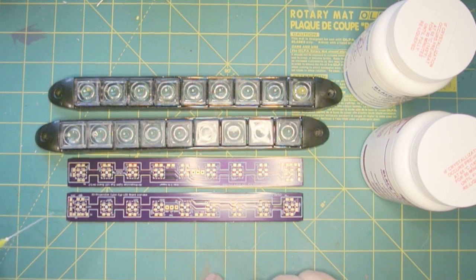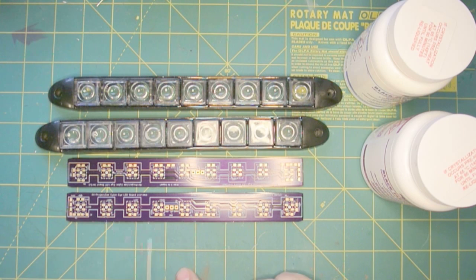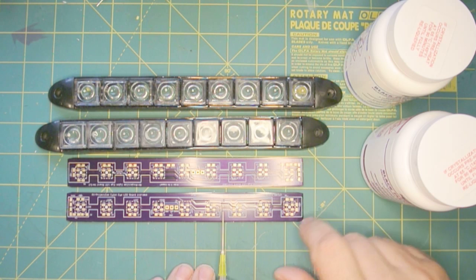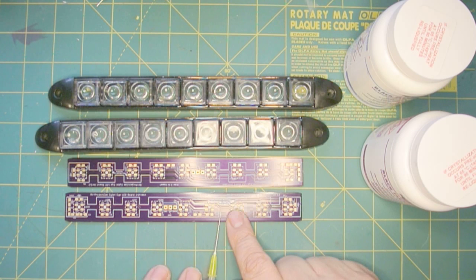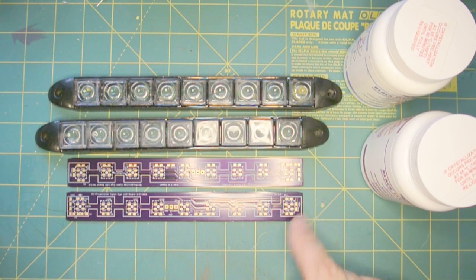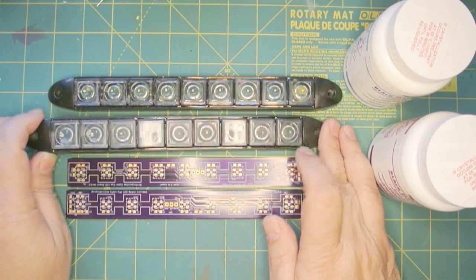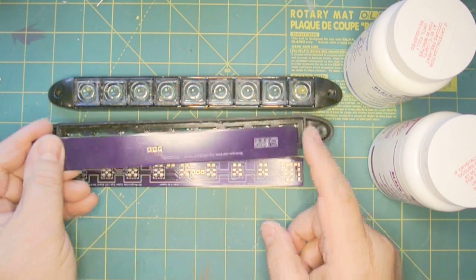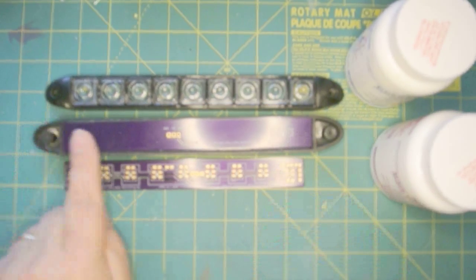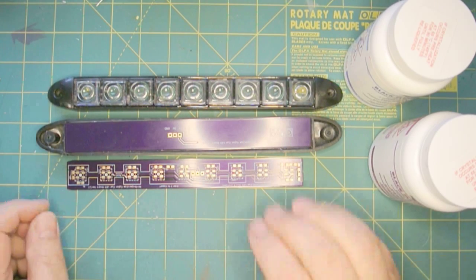The only parts that are different are here, which is the end of string. You may notice, if you've followed my project from the very beginning, that to save money I originally built it in three equal circuit boards that you put together. Well, I abandoned that approach, because I need to make sure this is waterproofed. After we're done building the board and we put the board into the slot here, I'm going to fill that full of this flexible epoxy as well. So it's going to be as sealed as sealed can get.